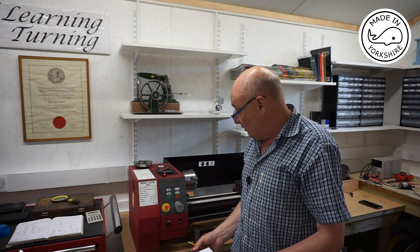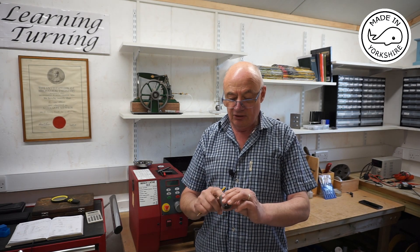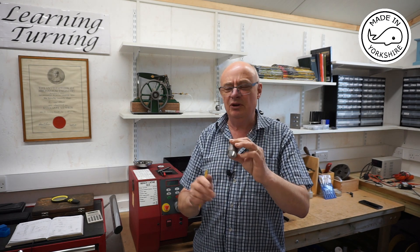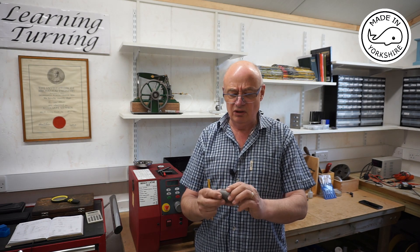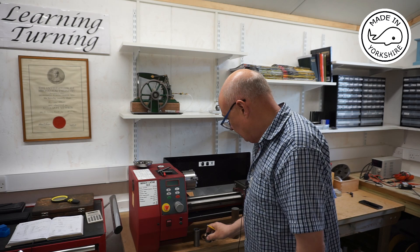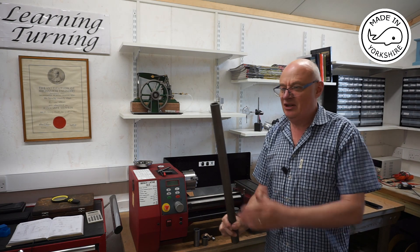It's also worth mentioning James Chaff — I think that's how you pronounce his surname. James came up with a really good idea: if you don't want to be bogged down with between centre boring, buy yourself some cold drawn seamless steel tube — CDS they call it. I bought some out of curiosity and the internal diameter is just consistent throughout. They do all different sizes and it's smooth as anything. All you need to do is machine the outside, get the length right, and away you go. I bought a long length of it — not sure what I'll do with it, but it might come in handy.